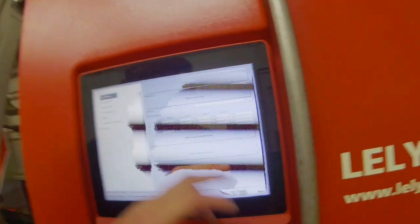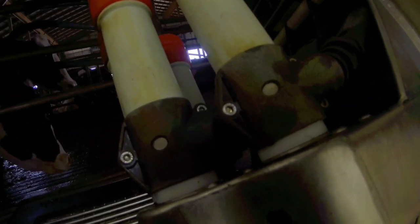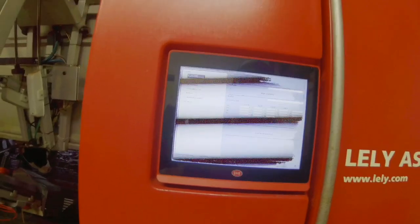We're off 0.35, 0.31, 0.28 — so yeah, that's really off. With the little screws in here we need to turn, you can tip them back a little bit. About all of them need to be tipped back a little bit. One of them was in pretty good shape, but we'll get them all tightened up. Wiggle them around, get them seated in there good, scan it again. Got them all done — one of them is right on the money and three are off a little bit, so we'll get those changed and get them all ready to roll.